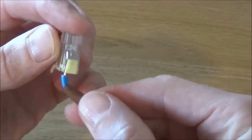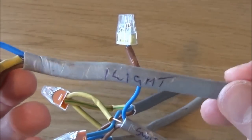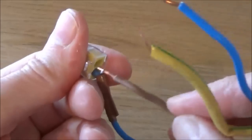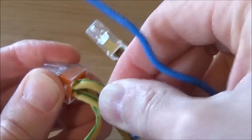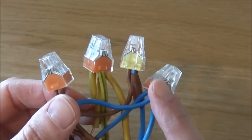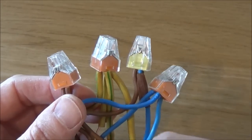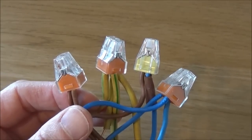Place the switch live into the twin connector — that will be our live. This is the cable that will go to your light fitting. With this, place the live into the live connector, the earth into the earth, and the neutral returns back into the neutral. These connector blocks can then sit inside your light fitting if it's deep enough, or if they need to be housed in an enclosure in the ceiling, we can use the Wago box junction box.